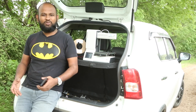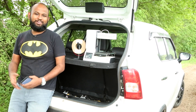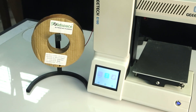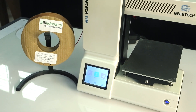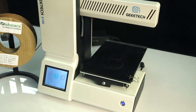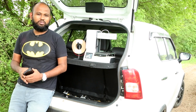Now let's look at the cons. Just because the 3D printer is gorgeous doesn't mean you can take it to the bedroom — the moving parts make a lot of noise, so it's okay if it stays in the living room. The power rating is low because it does not come with a heated bed, and they don't even provide any print surface. It just comes with the aluminium plate. I was able to cut some glass, put a vinyl with a carbon pattern on top, and it worked out really well — almost all my prints stuck really well to the plate.